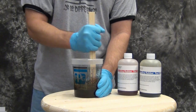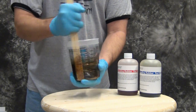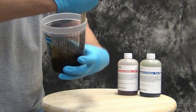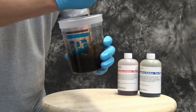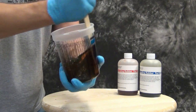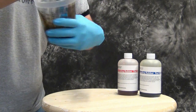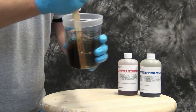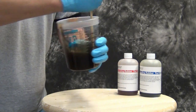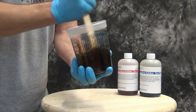You can speed up curing with heat, but ideally it's best to pour at room temperature and let it cure overnight. Once you mix this up, it has the consistency of some of our urethane rubbers like 7560 or 7559. As with any rubber formula with an A-B mix like this, you want to make sure to scrape the sides and bottom of the container. Part A is considerably thicker than Part B, so take care to really mix that up well — a good 45 seconds to a minute to get a thorough mix on the two ingredients.